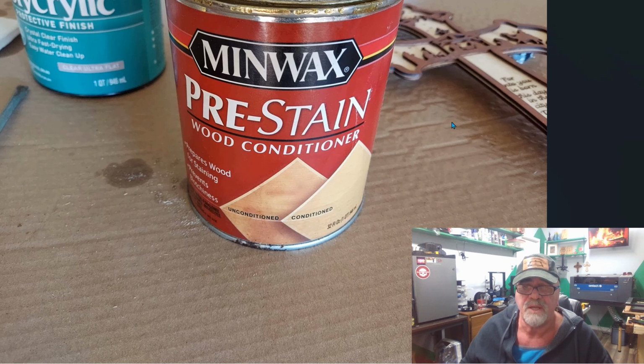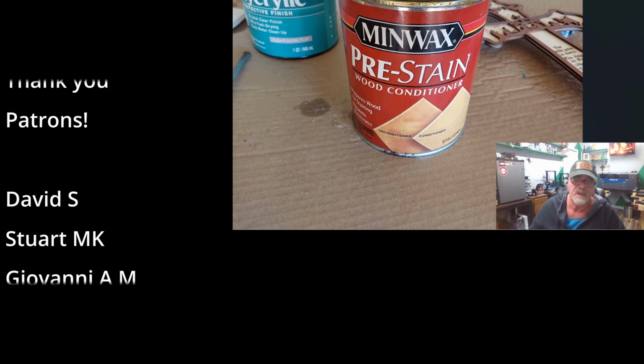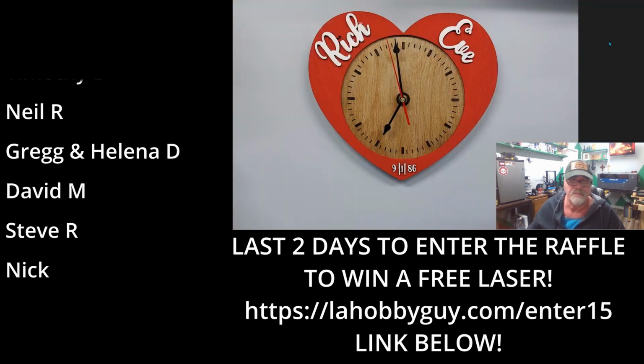If you pre-stain your wood, you're never going to have a problem with blotchiness. And this goes on real easy, just with a paper towel. You wipe it on, put on a liberal amount, let it dry. It dries in just a couple of minutes. And then you can either put your stain or your finish on. So what I did was I used the pre-stain, and then I put the polyacrylic on top. And this is what I wound up with here.